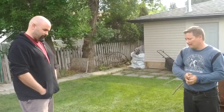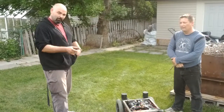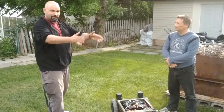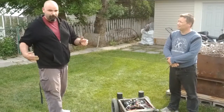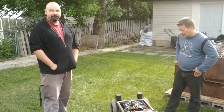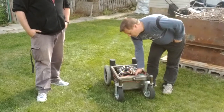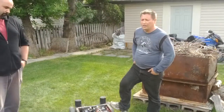One of our problems was that forward inertia really messed us up — when you drove forward and tried to turn left, my old code would drop the power out of the turning motor and the inertia would just keep carrying you forward. Dan's reverse pulsing has allowed it to actually brake instead of just slowing down. We now have a very good beginning of active braking incorporated with the existing version 1.4 H-bridges on the moving furniture platforms. I've been monitoring the temperature of the H-bridges for potential overheating from reverse braking and they're not even coming close to warming up — we're talking ambient temperature.